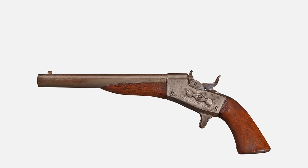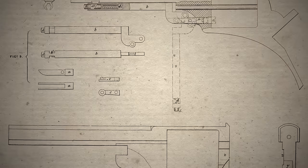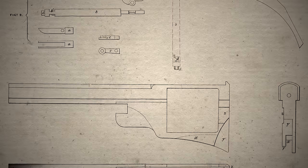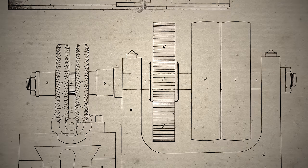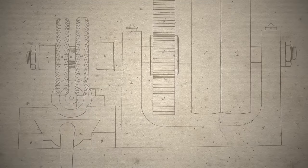Once again, in 1866, John Adams filed a revolver patent, better to be prepared in case the service changed its mind. Again, we see a two-piece firearm and a further refinement of his compounded rammer set underneath the barrel. More importantly, however, this patent covers specialty machinery, which was meant to quickly cut the frame in a rapid, repeatable fashion. The hope was to produce with at least partial machine operation. The small parts, however, were still produced with the usual jigs and files or sourced from the trade.